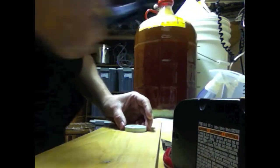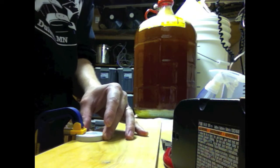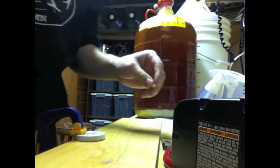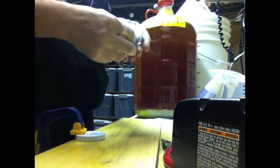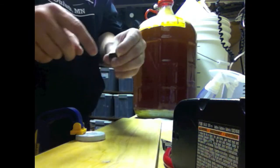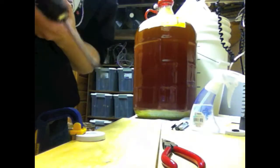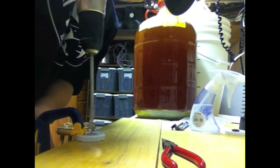Basically what we're going to do is drill a little hole inside the cap. We're going to put the grommet in the hole and it will be ready to go. That is it. So we're drilling a hole using a half-inch drill bit. Don't be fooled — even though the hole in the center of the grommet is three-eighths inch, you're actually going to need about a half inch to drill through to get this onto your cap. Grab your half-inch drill bit and very carefully drill through your cap.